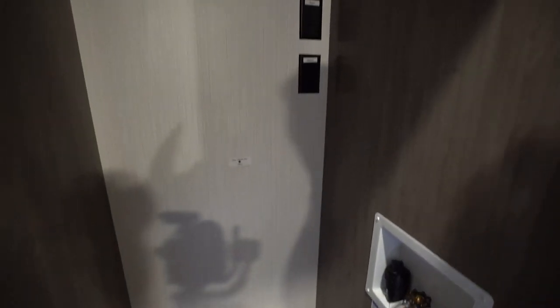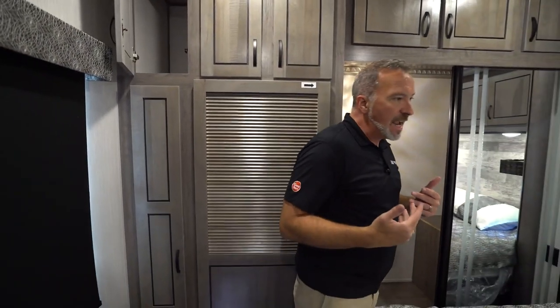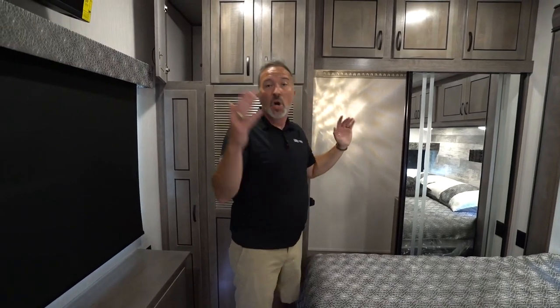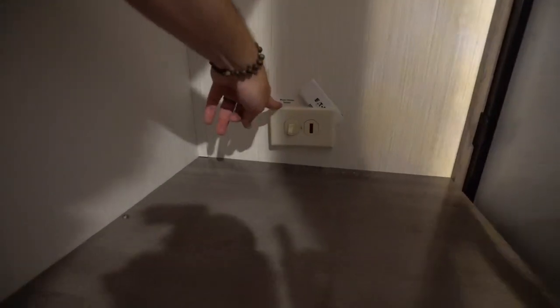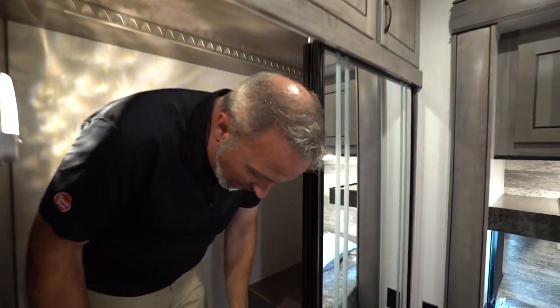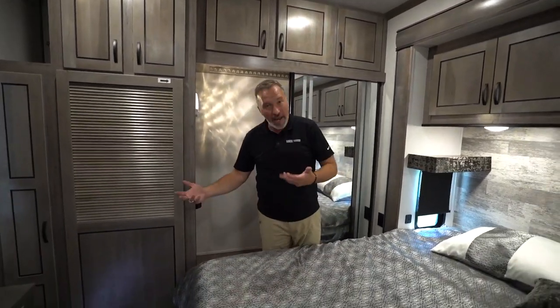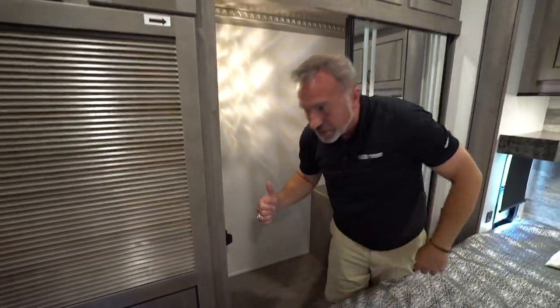There's a slide door right here for your washer/dryer prep, which is stackable, with a separate 110 outlet there. Since you do have a 20-gallon water heater, the power switch for that water heater will be in the closet, in the cottage bedroom, or in the bathroom — on this one it's right inside here. You see this little switch with the red light? It'll say water heater switch — cut that on, and now your 20-gallon electric water heater is on and running. If you ever have issues with no hot water, make sure that switch is on and you're plugged into power. You can also check the fuse panel right here — if any fuses are lit up red, that means they're faulty. If everything looks good and you're still not getting juice, bring it in and let our folks take care of it.